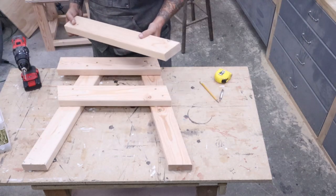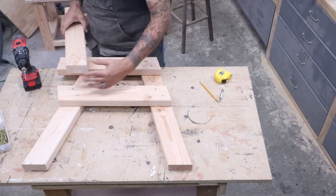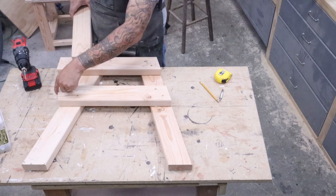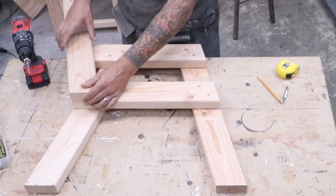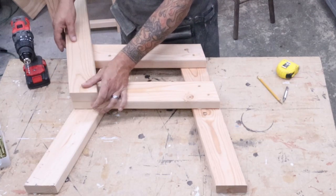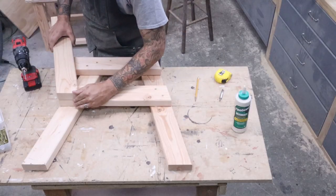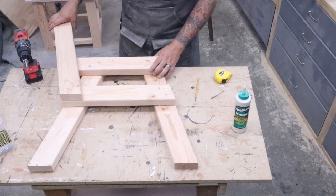The next thing is to put the back support in. This goes on the inside — we just line up the bevel cut with the bottom edge and the back edge of the bench with the back edge of the bevel cut. If lined up properly, these two edges will align, as will the corner of the arm support. We'll mark it, glue it, and screw it together, then do the same to the other side.